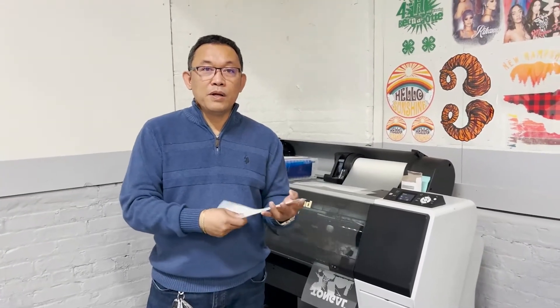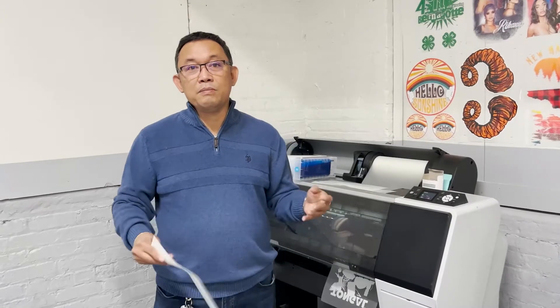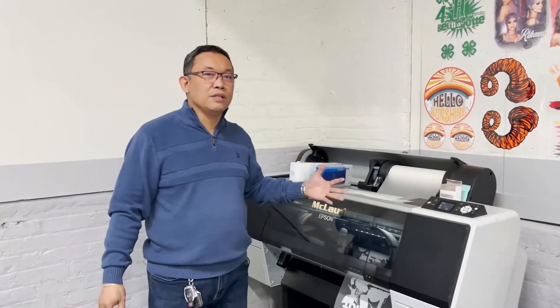So if you are using other printers, the solution is to replace the print head. You know how much the cost of replacing the print head? It's between $2,500 to $3,500. For this printer, your cost is about $3,000, because when you replace the print head, you need to replace the wiper, the damper, and the print head itself, and the capping station. The capping station is the one that sucks the ink. So if you replace the print head, be sure you replace the rest of it. Don't partially do it, because if your capping station is not working properly, you will just clog the head again.